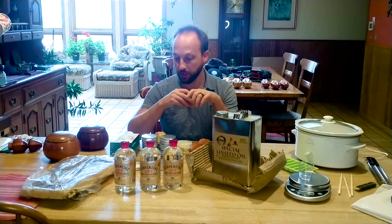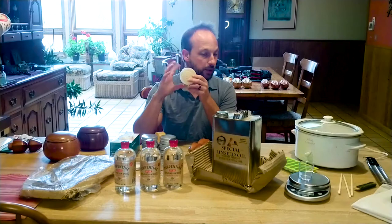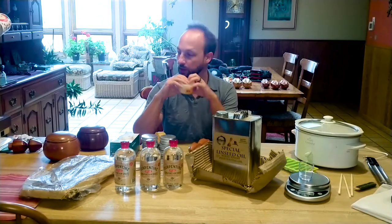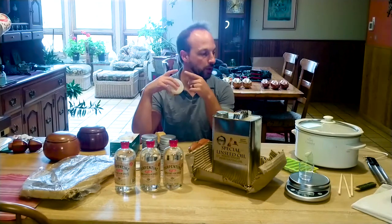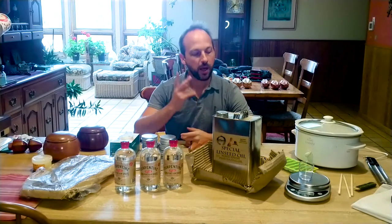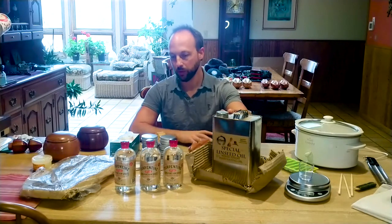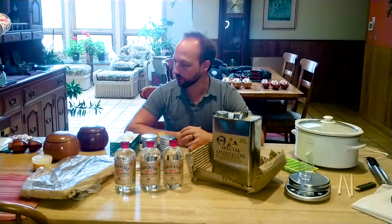I have seen wax pastes made with three or four parts linseed to one part beeswax, and that's probably what you're getting when you get a product like this, just linseed and beeswax. But I want to add turpentine for two reasons. One is that the softer texture will make it easier to use, and the second is that turpentine will help it penetrate into the wood. So I want the oil in the wood polymerizing, creating a more protective layer so that the bowls last longer.